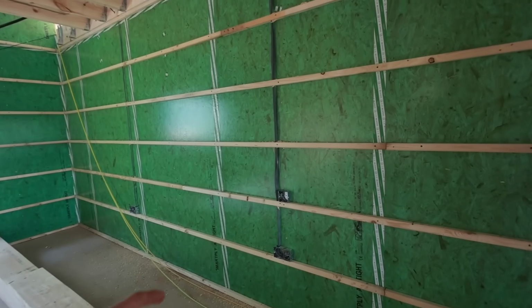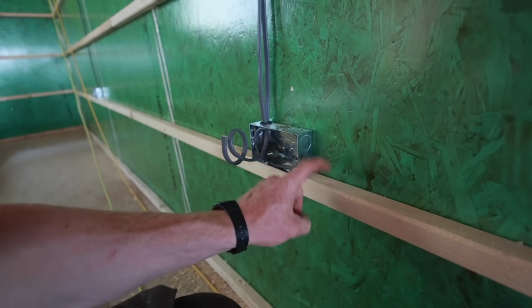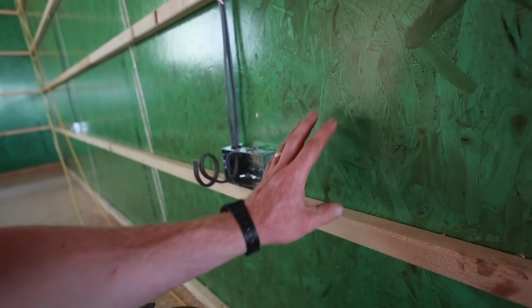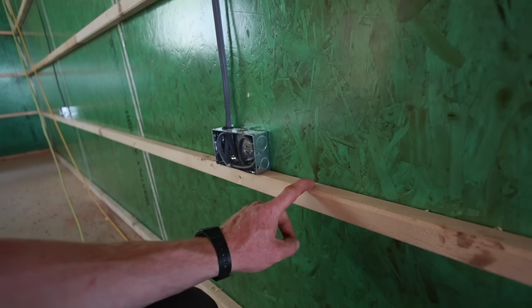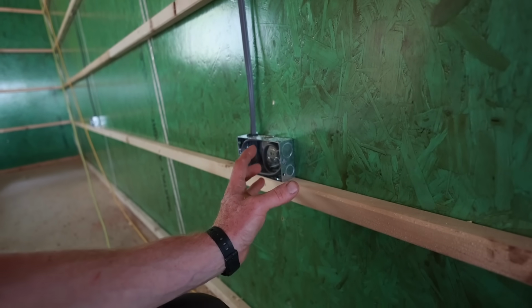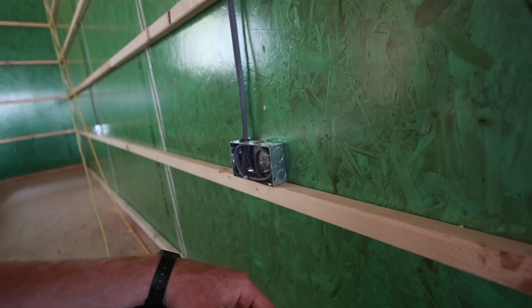So the way we've done it, we obviously set out the battens on the wall at the correct height. So now when James needs to come in and fix these back boxes on, he can use penny washers and screws and fix them to our batten, and he's not actually putting anything into the OSB or into the wall, so we're not compromising any of our airtightness or vapor barrier, which works well, and they're nice and solid. These battens are 30, I don't know, 32 mil, something like that. So these boxes, I imagine, are 35, so they stick out a fraction, which is quite handy. Means when we come to fit our plasterboard, we can offer the plasterboard up, give it a bump, and then when we remove it, we'll be able to see where this metal has dented the back and cut it out.